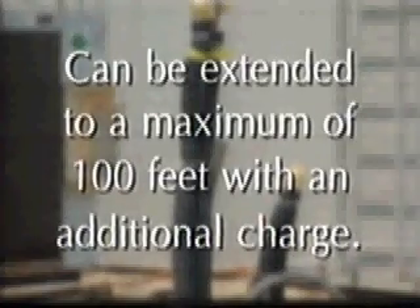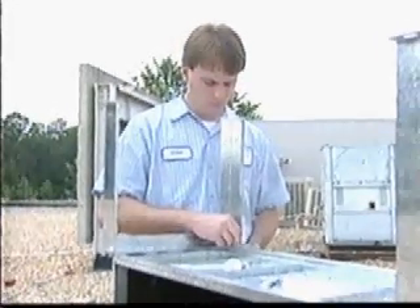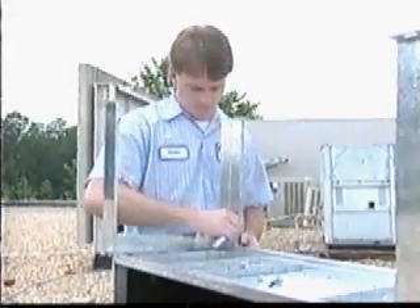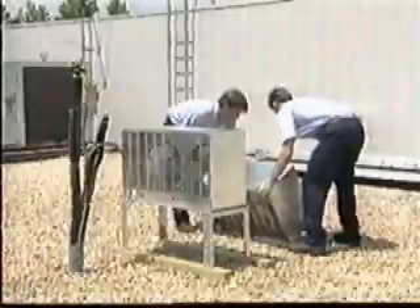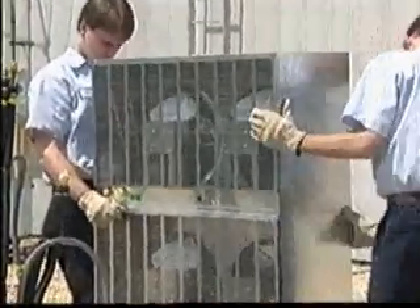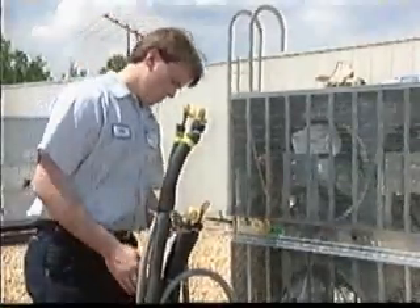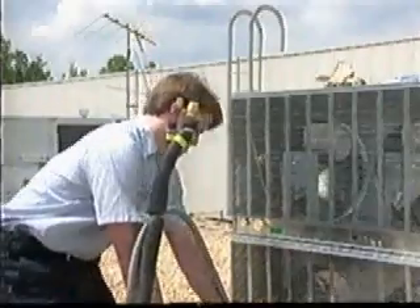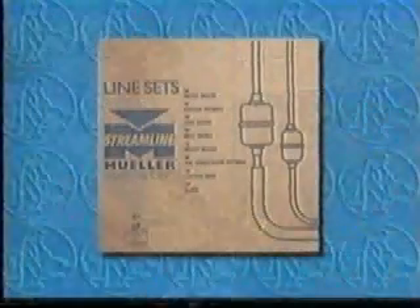This can be extended to a maximum of 100 feet with an additional charge. Consult the manual for recommendations for line size and charge amounts. To install the remote condenser unit, first remove it from the carton and secure the legs squarely with eight M8 by 16-millimeter hexagon bolts and M8 nuts. Next, secure the legs to the roof curb with eight bolts in the eight mounting holes. When installing two remote condenser units, you may stack them to save space — attach the upper condenser unit on top of the lower unit and secure it with the four screws provided. When installing two copper tubing sets between the ice makers and condenser units, take extra care to mark the refrigerant lines and electrical connections to assure they do not get crossed during installation.